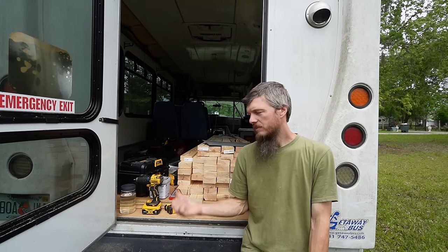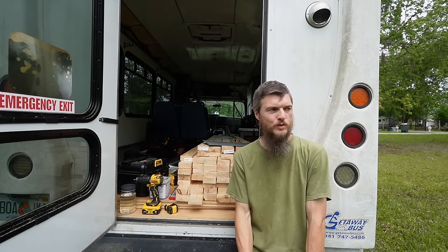So we're going to ignore the metal for a little while and start with the wood. We got a huge pile of 2x4s that we're going to use as purlins — just strips of wood we'll screw to the roof so that we have something to attach our metal to. We're using 2x4s instead of the typical 1x4s because we want a sturdy roof, but also we don't want the screws poking through into our metal. We have an old flat metal roof up there right now, and if we used 1x4s, every roofing screw we drove in could hit that metal and create leak points. We'd rather keep as much of the original roof intact as we can because that's an extra barrier of protection.